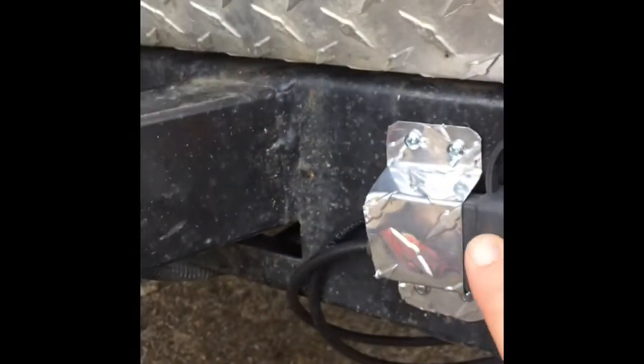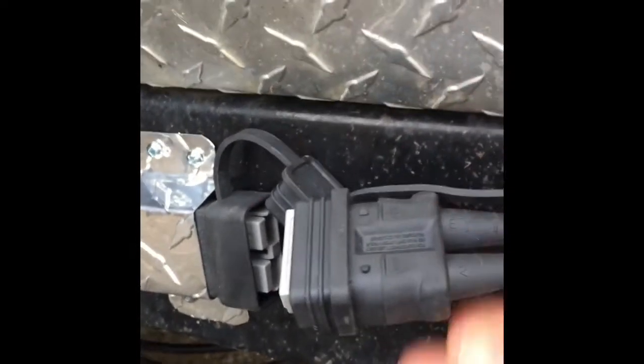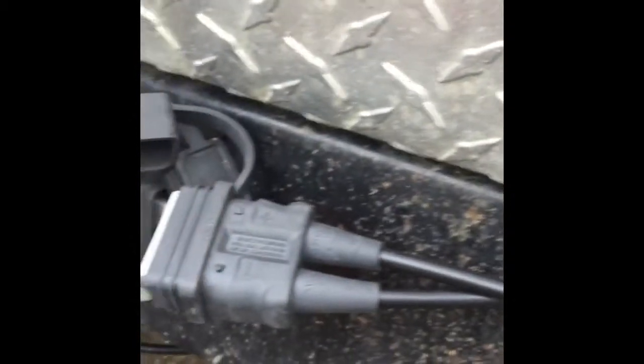This side is coming from the charge controller to the solar panels. I just made this custom bracket. So this is how I can disconnect the panels if I need to. And then I ordered 25 more feet of basically an extension to go between these two so that I can take the panels off, and I just unclip the wires like that. I haven't really gone anywhere with this yet, so we'll see how that works.